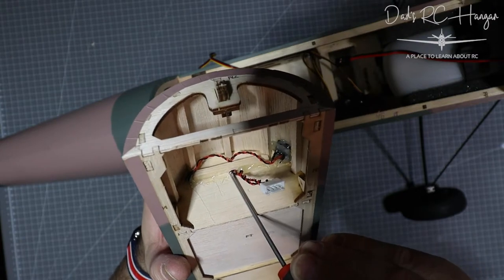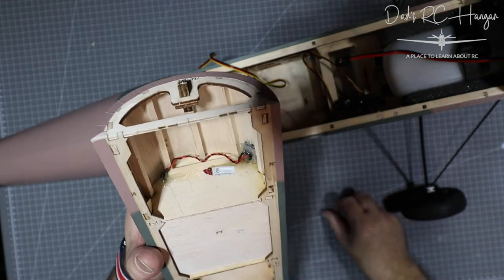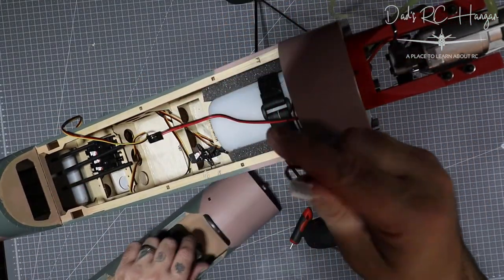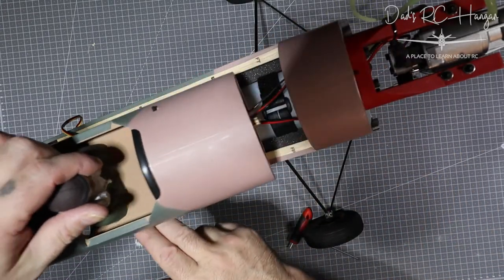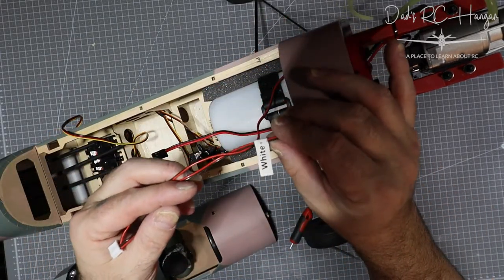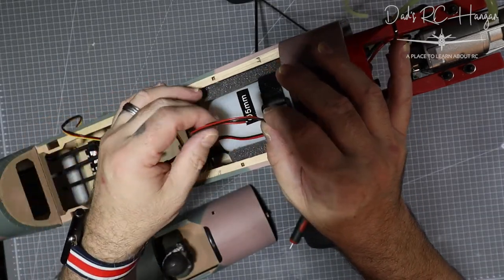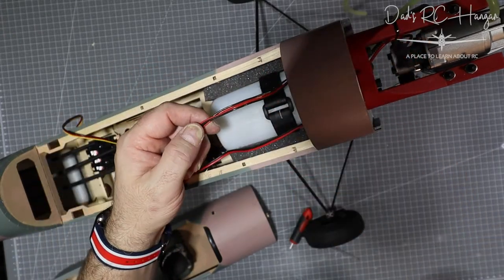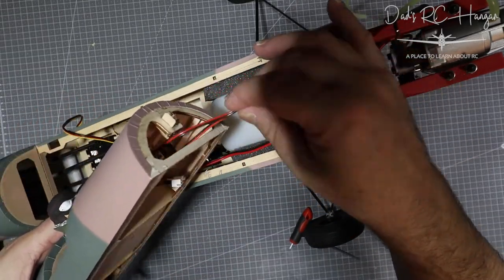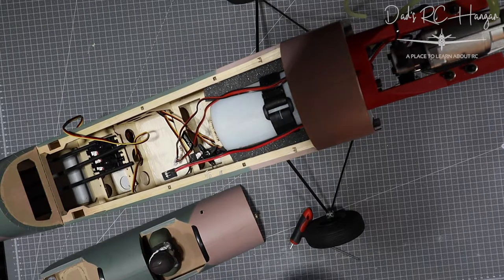A bit of balsa across there with a nick in the middle so the cables don't tug on the electronics — they just sit there. The way this will go in is it will plug in there. I'll probably shorten this cable. I also put a white LED so I knew which one was the LED and which was the switch. I'm probably going to chop these back and redo the ends — I actually quite like crimping, it's therapeutic. Put a bit of music on and crimp away.